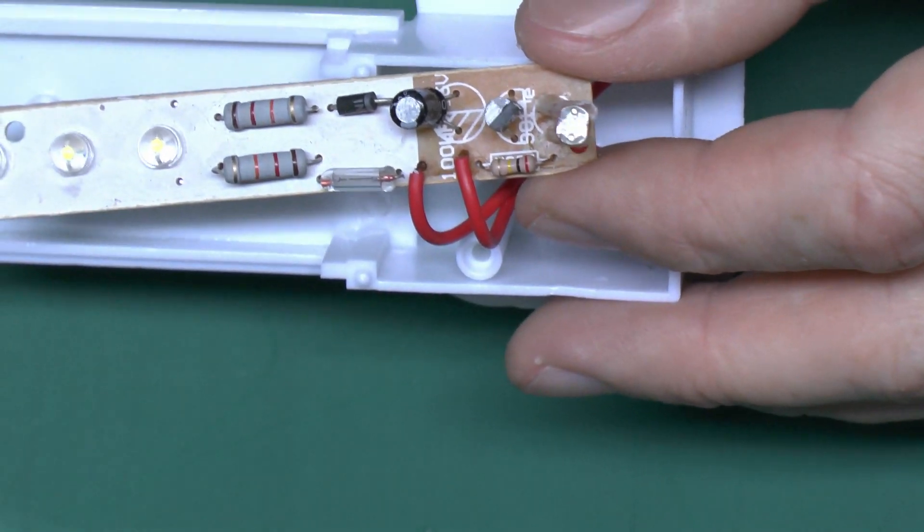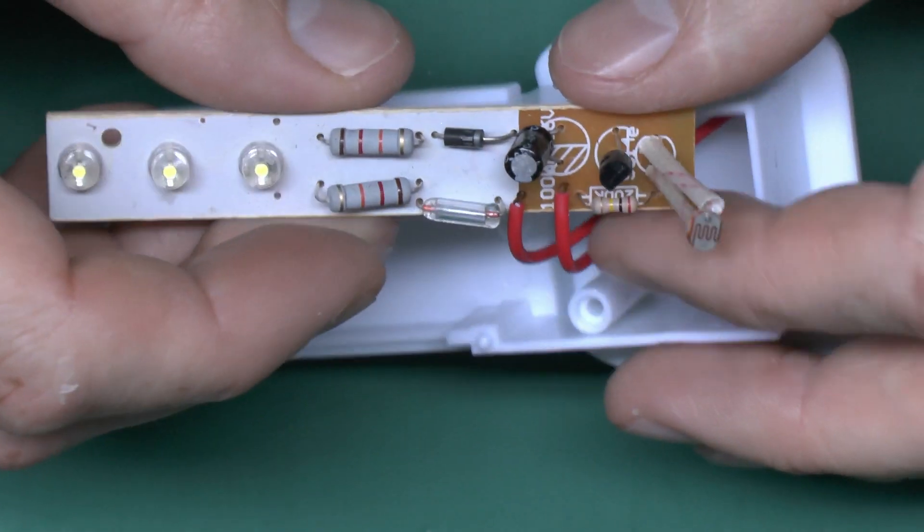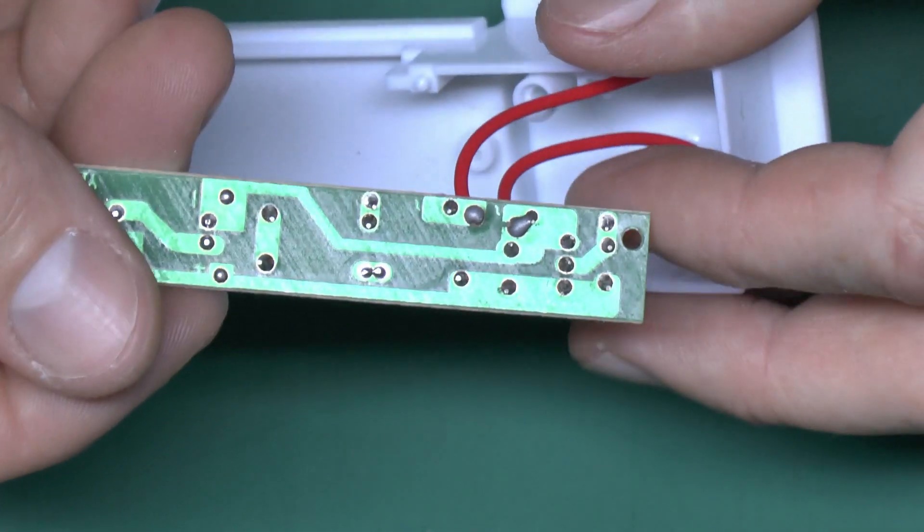Other things on the board here: we've got a couple of fairly large resistors, probably one watt or something. Three LEDs there. There's supposed to be a diode, and we've got a small capacitor. This presumably is a transistor of some sort. And then of course the light sensor, which presumably is a light-sensitive resistor — an LDR. Fixed in there, just two bits of sleeving to cover the two wires to that. And another smaller resistor there. So not a great deal in there really, but then what did you expect for 99p?